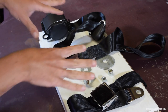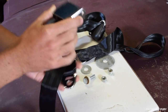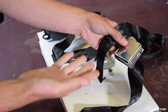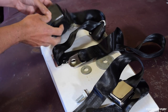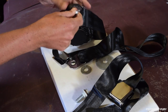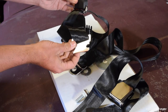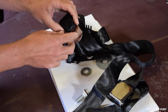These are the main components of my install. I have the seat belt, which connects to the standard default hole in the middle transmission tunnel — using the actual factory bolt right through the hole to replace the existing seat belt, so that's easy. These are the nice chrome-plated aircraft-style buckles — not super original to this car, but period-correct and they look real nice, just black on chrome. Then the three-point system: you have a piece that mounts on the floorboard near the back seat, and this bolt goes through a top pivot piece that mounts near the roof line. You've got the buckle that slides along the belt, and finally a mount that goes to your factory seat belt location using the factory bolt.